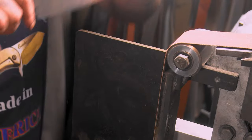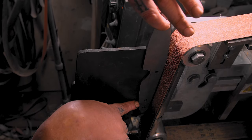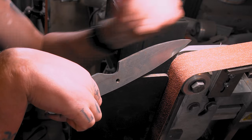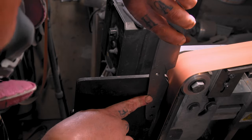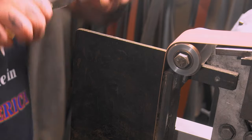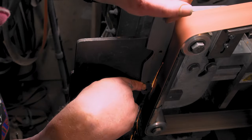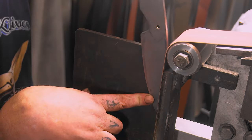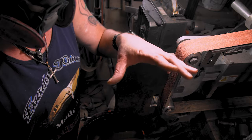It's not ideal, but it works. We're just going to do the spines here, and I'll show you with the small wheel too, when I try to get it as good as possible. I'm not doing it here because I want all my grind lines going across — that way, when I strike my line, I have the cross pattern. It's just something that I do; you might not even like it. Next — small wheel — and then I'm going back to the horizontal and finishing up everything else.